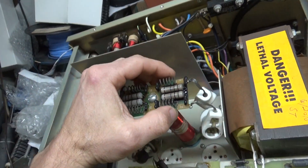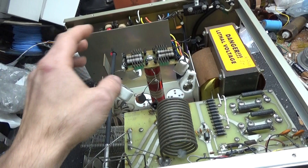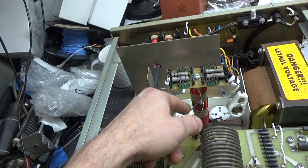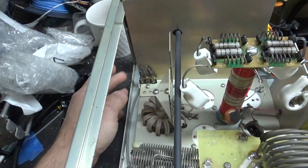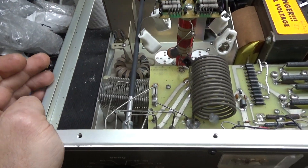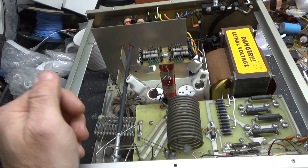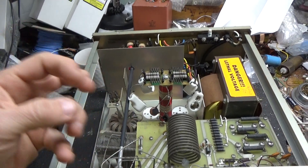I'm going to change the parasitic board due to severe heating. So I'll change these three pieces: two plate blocking caps, a plate choke, and a parasitic board. I'm going to take this whole assembly out, ground the grids the proper way, do the bias modification, clean the input and output rotary switches with Deoxit Gold, and check everything else over. It also needs new SO239 connectors in the back because there's no tension to the pin.